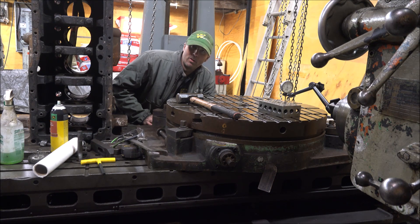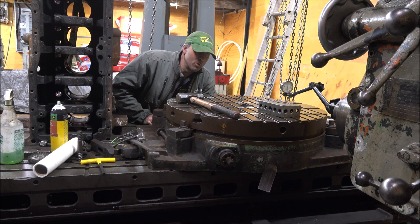I hope you were getting that. And that way you're not stacking errors by setting up multiple times to do one operation. The fewer times you clamp and move the part, once you get it indicated in, the better it is. The table feels good and smooth. It might not be the prettiest thing in the world, but it'll do the job. I hope you enjoyed getting to see how I went about getting this trued up. I slide the block around on top of it and I get the same indicating readings, so I think it's in good shape for doing the job. Thanks for watching, thanks for subscribing, I'll catch y'all later.